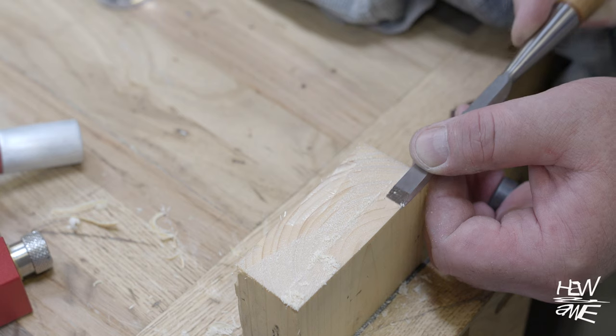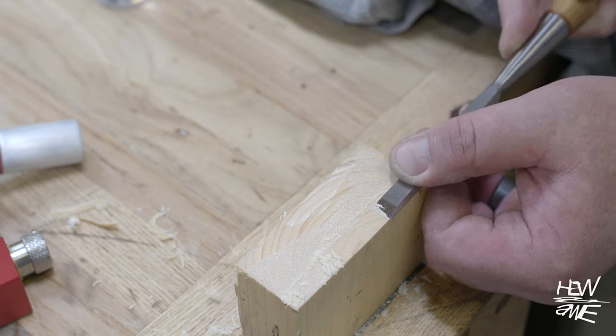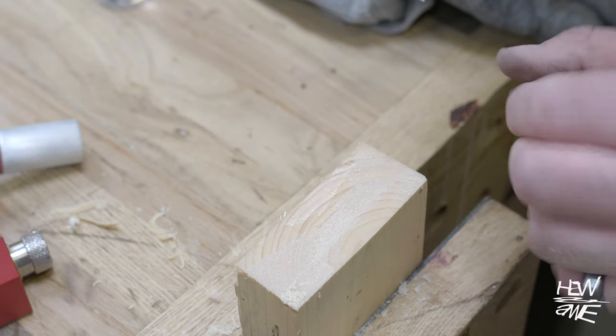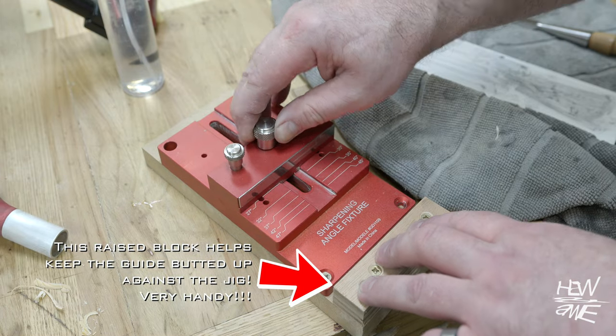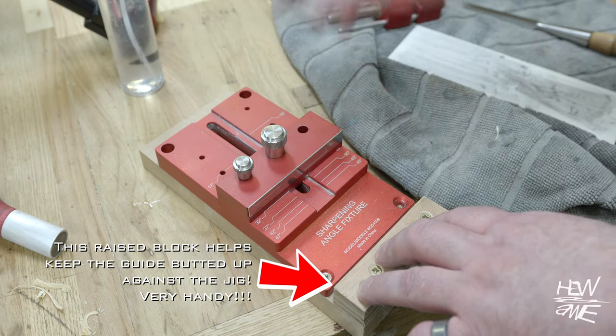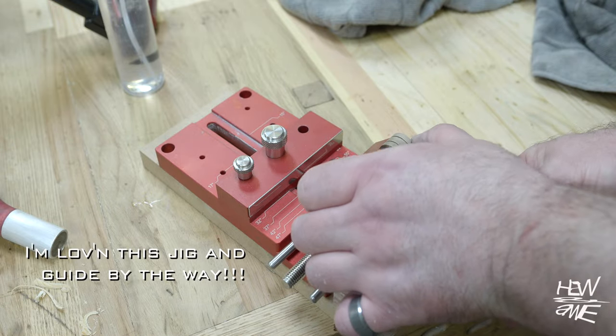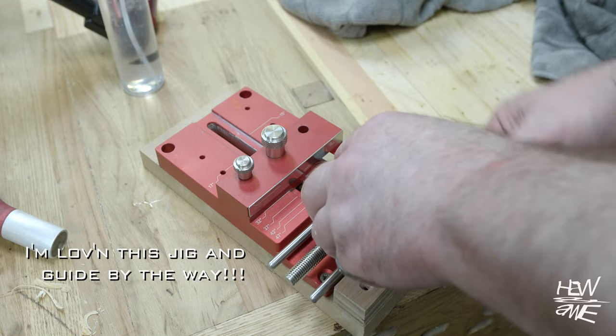It's this stage for me that led me down this rabbit hole. It's a bit like a butter knife trying to cut a steak. Never really sharp enough. So now, instead of a 30 degree primary bevel and the secondary bevel of 32 degrees, I'm going to regrind the primary bevel to 32 degrees.